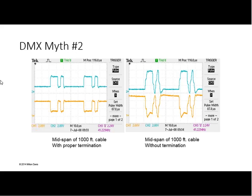Would another issue be if you're using the improper cable? The correct characteristics, and adding the terminator screws up those characteristics even worse. If someone's used a mic cable and they put a terminator on, you've really screwed up the equation. Yep, now you formed an RC circuit and made things worse. We touch on cabling a little bit later on too, but that's absolutely a source of issues.